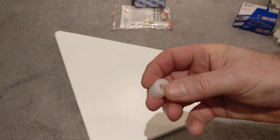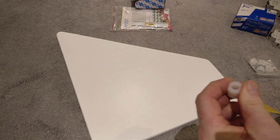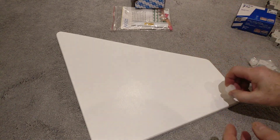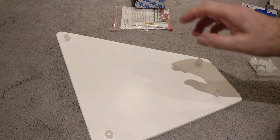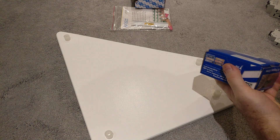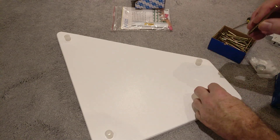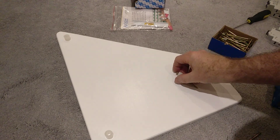Having done that, the board will be mounted on the wall using these spacers. I've got a whole pack of different sizes — some wider ones, some narrower ones. These are 20mm, so that's thicker than any tiles that might go behind here. The way this will work, I'll put the spacers on the board and then drill through, and using these screws — a nice 3-inch screw — that will go through the board, through the spacer, and into the wall. So that's how that will get mounted.